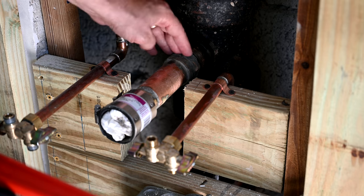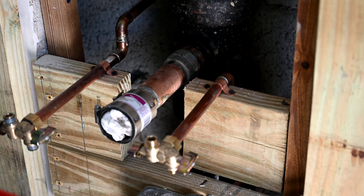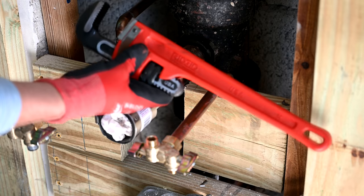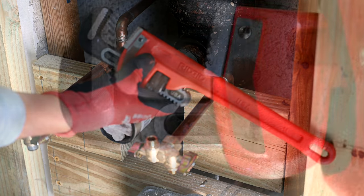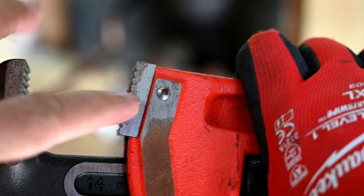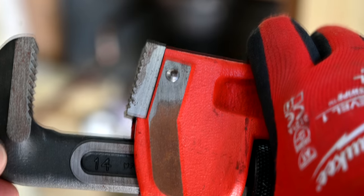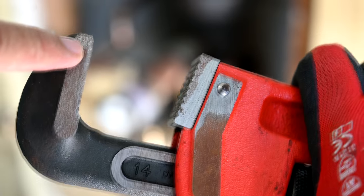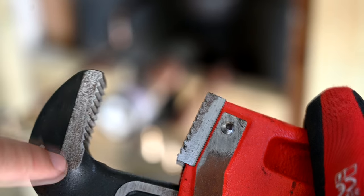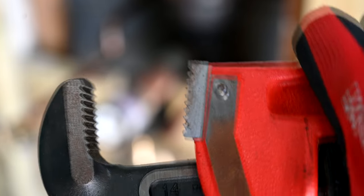The point where we would attach our wrench is set back behind the wall and there are all sorts of pipes back in there. We're going to try first with our regular rigid pipe wrench — it has to go in in this orientation. The reason is because the teeth on the stationary part are angled upwards so they will dig into the nut as we loosen it, and the teeth on the claw side — the movable side — are angled downward so they will actually force it counterclockwise.